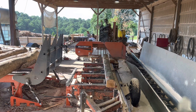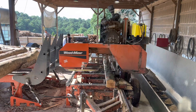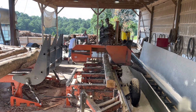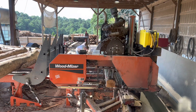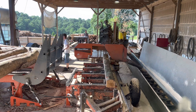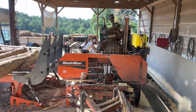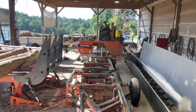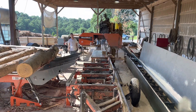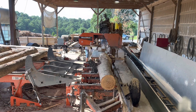The pulley I'm talking about is the pulley right here behind this housing — it's where the back of the motor crankshaft connects and spins to give your blade RPM. You've got a belt in that housing. If you're new to the channel or you've just picked up an LT-70, this probably won't matter to you unless you had a defective pulley. But the drive belt runs the blade and it's got three pulleys in the system: one tensioner and two drive pulleys — one little and one big. The little one on the back of the motor is the one that probably needs to be replaced if you've got a mill with quite a few hours. You'll think you've got a brand new mill when you put one on — it just cuts so much faster.